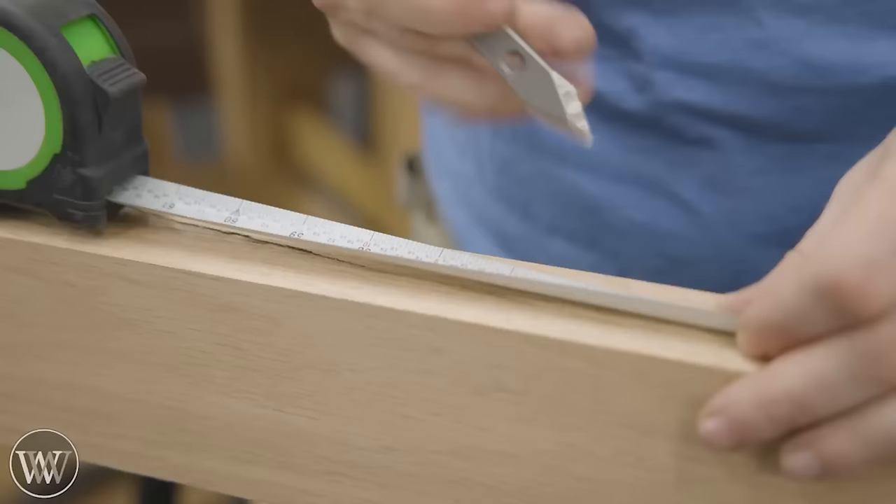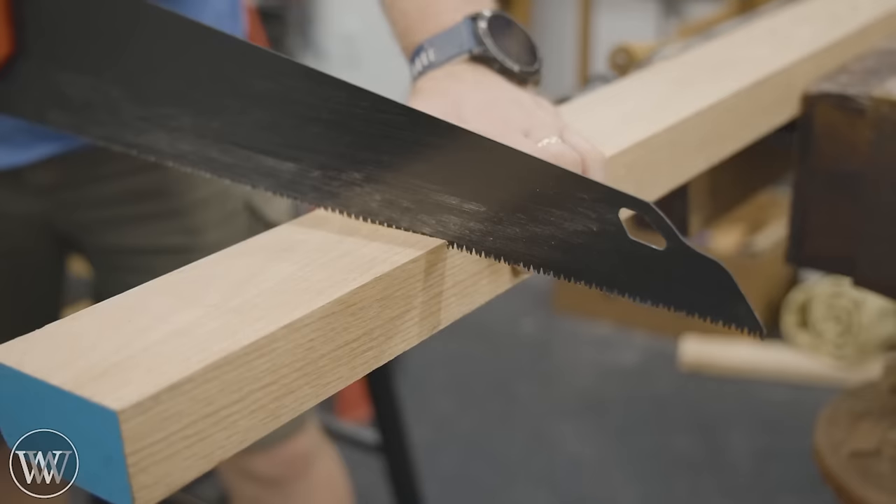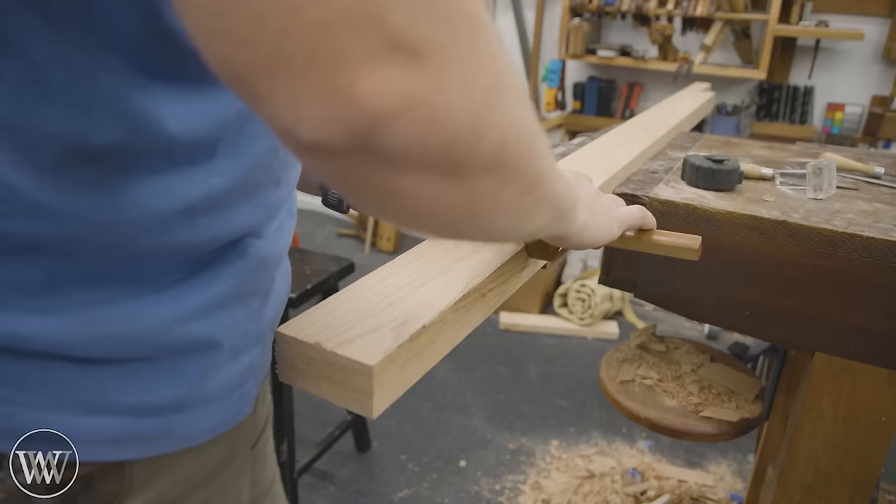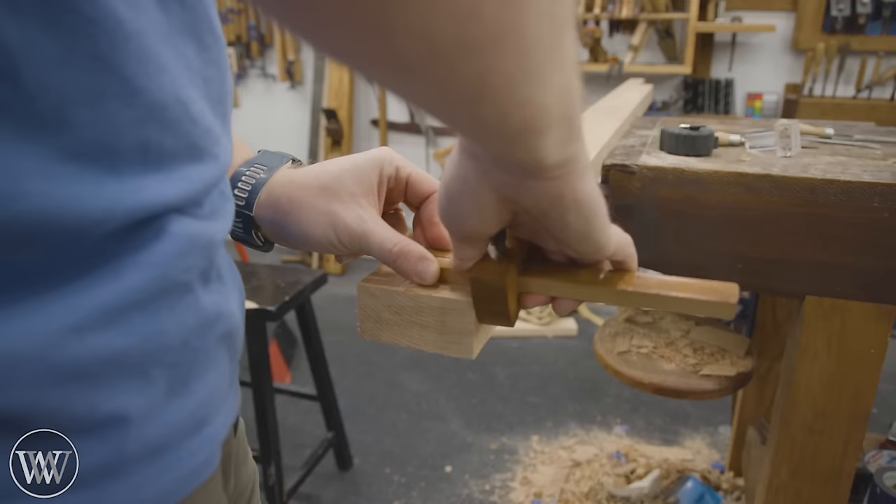Let's pick up where we left off last time with some red oak. We're going to start here with the long beams. These are the skirts that will go from end to end on the table. First thing we need to do is find the center point where we can put a cross member through. We need another member to go through either of the two side skirts and extend out the sides — this is what the net will actually attach to. Now that I have the table put together and all the legs on, I can figure out how long this centerpiece needs to be.